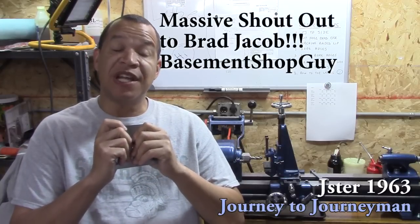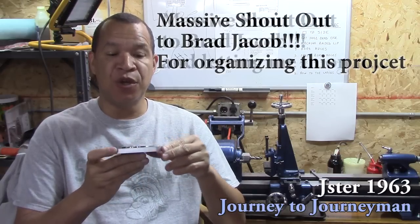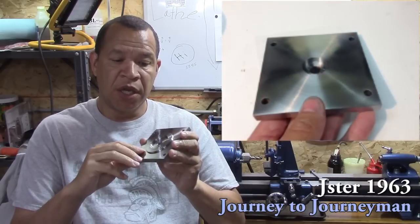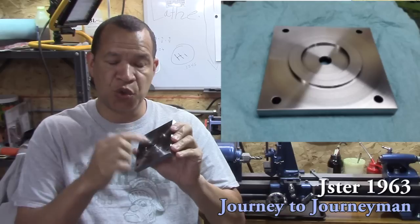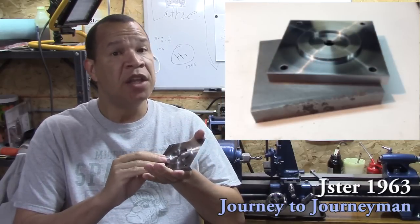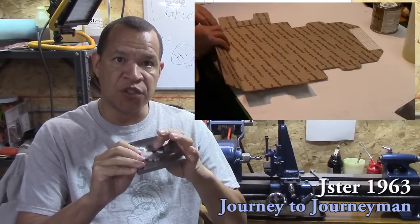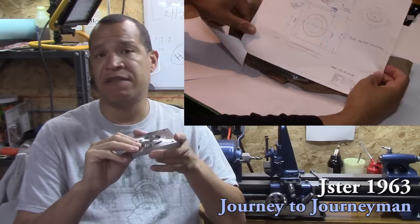Hey guys, I'd like to share a couple of lessons learned on this. First of all, this is at the ragged edge of what this lathe can do. And if you take your time, small cuts, you can get her done. If I could do my order of operations again, I think the first dimension I'd have tackled, once I got the block squared up, is the most critical dimension, which was that plus or minus 1,000th. That's just because I had so many hours into this piece by the time I tackled that, if I'd screwed that up, I'd have wasted a whole bunch of time. So it might have been better to do that first, and if I screw that dimension up, then scrap that piece and start all over, and not waste a lot of days and hours on this.